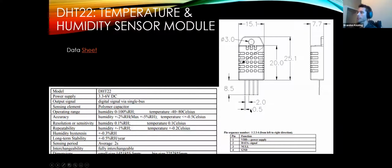Anytime you have data, you're generally going to have a pull-up resistor. But that just kind of comes from practice and experience. It's a good rule of thumb to just have a 10K inline from VCC to data. It's essentially implied by having any data pin.